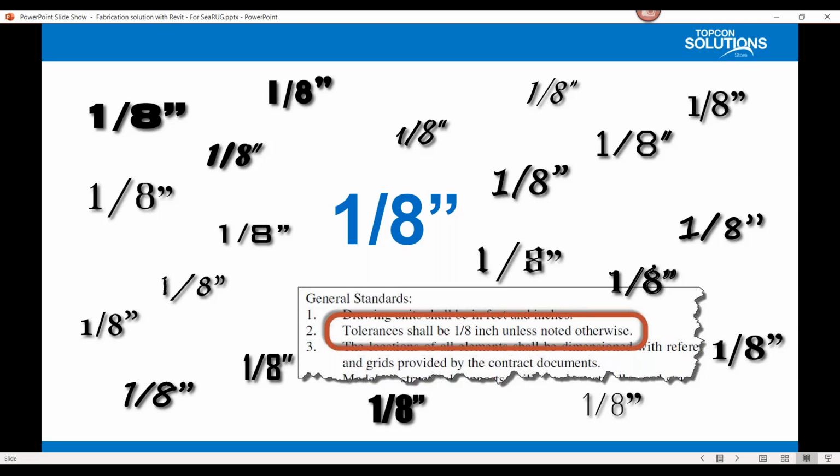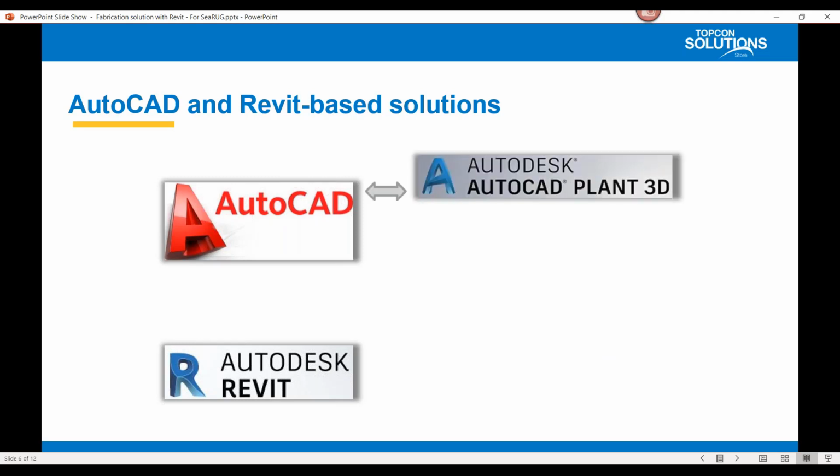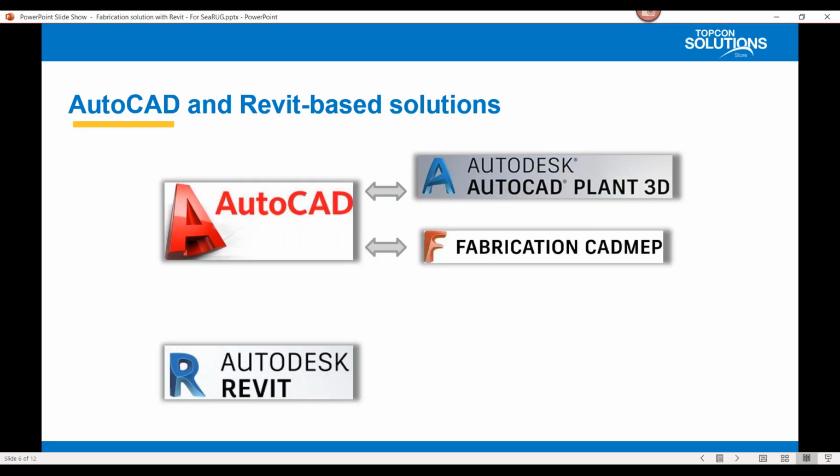With regard to this, there's a couple of different solutions that come from Autodesk for fabrication. Some of them are AutoCAD based, and then there's Revit for fabrication. Some of our customers are using Plant 3D, which is an AutoCAD based one to get the fabrication done, and it also does P&IDs as well. Also, there's another CAD-based one, which is Fabrication CAD MEP. Depending on what you're doing, you can additionally get CAMduct with that. Obviously, that's a duct thing for nesting and sending it to the plasma cutters or coil line. And then additionally, you can have ESTmep for estimation.